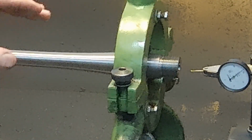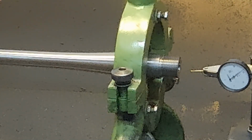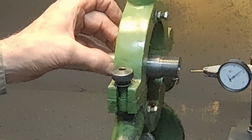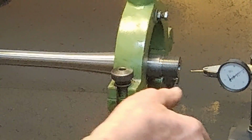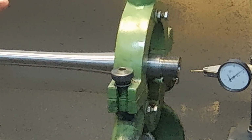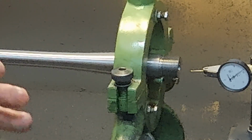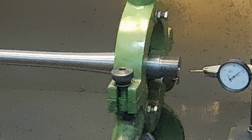And now another thing on the steady. These things pop into my head, and I'm sorry if it's confusing. It's possible, if you're running a little eccentric and you want to do better, you can put a sleeve on the barrel, and with 4 adjustment screws, a spider as it were, you can adjust that to where your bore is running perfectly true. And when you've done that, essentially you're kind of holding the barrel in a mini 4-jaw chuck, and you've aligned it, and you can work that way just as well as if you were working in the chuck itself.